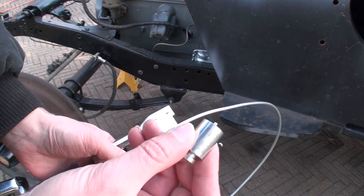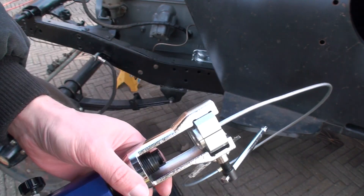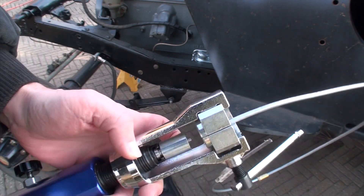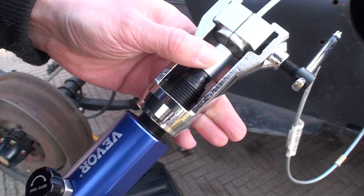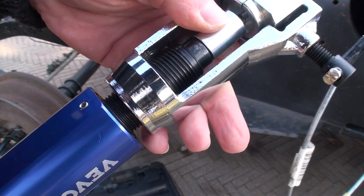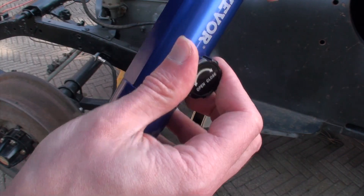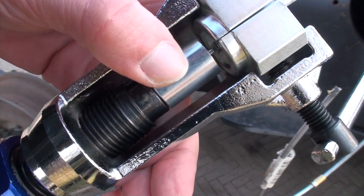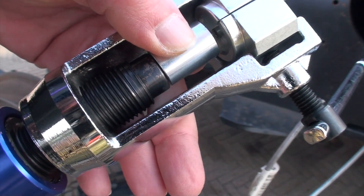Now find the tool for your first step — again, it's marked — and this will drop into the hydraulic flaring tool. Next you want to rotate the entire body of the flaring tool to get it closer, and when you're just close enough, close the valve.